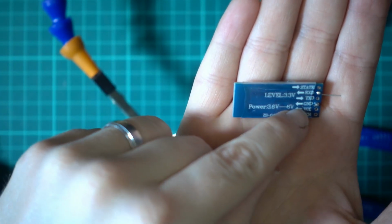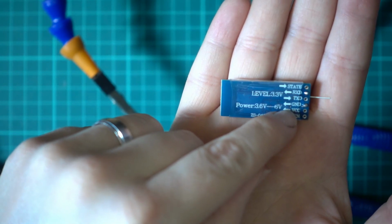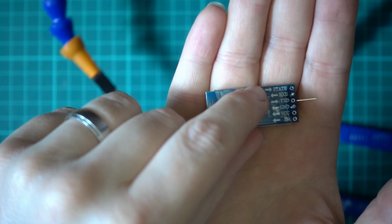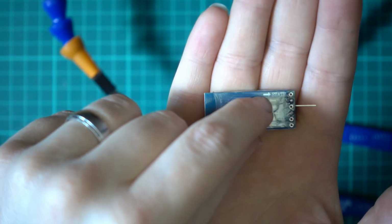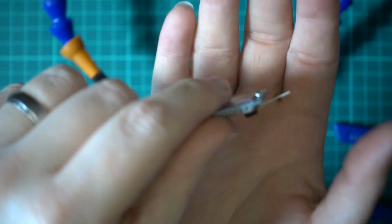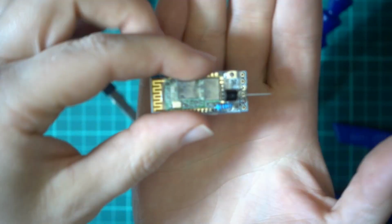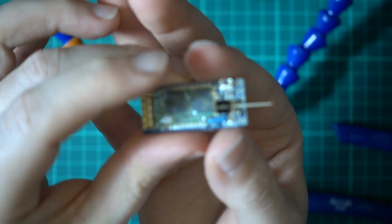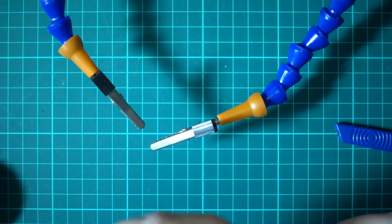We're going to have one for VCC, which is going to be the power in, one for ground, and then the TX from the SmartPort is actually quite convenient. It lines up with TX. It actually goes on that leg. As again, don't wire it to the Bluetooth module itself. It wires onto that here, which obviously will cut short. So I'm going to cut that short now.